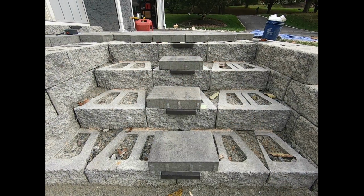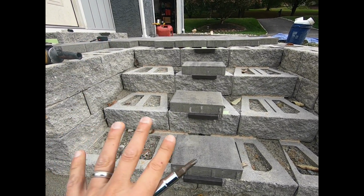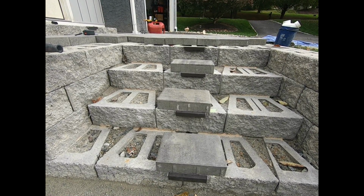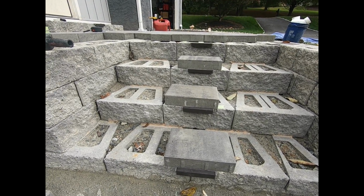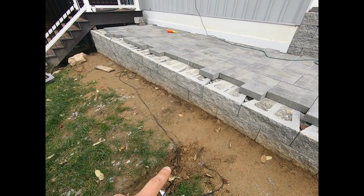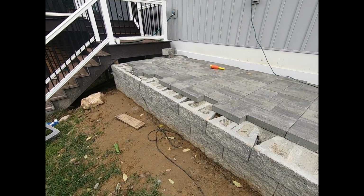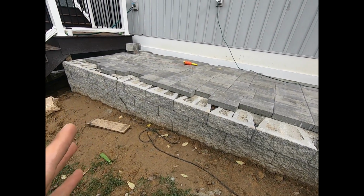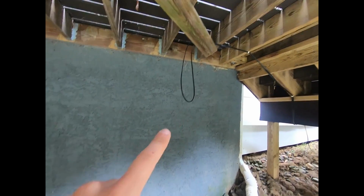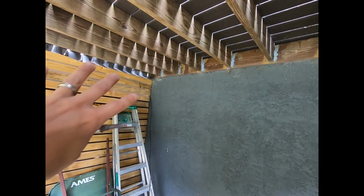Okay, I got all my step lights in. I got one right up there as well. I wanted to do this now for two reasons. One, to finish this video, but also I want to test the lights and the transformer. Next, I will do these lights using this wire, same concept, but for now I want to go ahead and wire up the transformer to test the lights and make sure everything is working before I proceed further. This wire, I'm going to splice it and run it back to the transformer, which is in there.